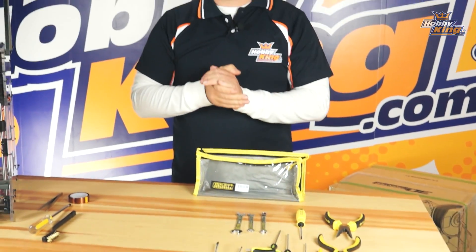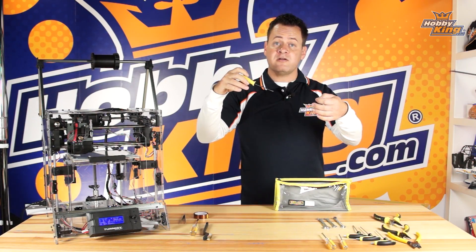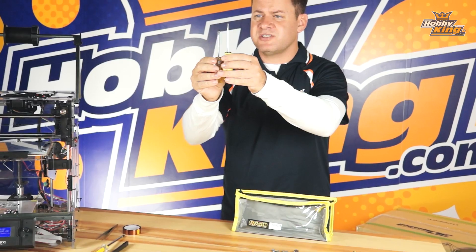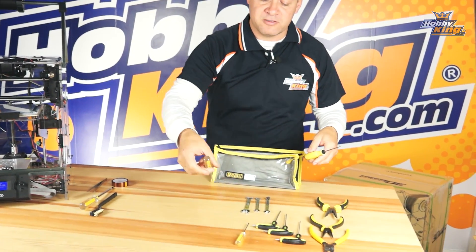As far as screwdrivers are concerned, the number one key screwdriver that you're going to need is this little shorty flat blade. The reason for this is that on the back of this panel right over here, we've got some wires that come in with a bus bar, and we need this thin-style flat blade versus the thicker-style flat blade so that it can drop into the hole itself without gouging the plastic. So definitely make sure you've got one of those.